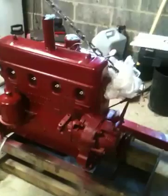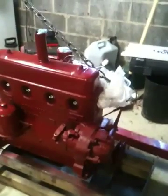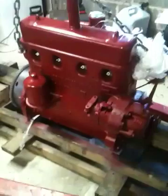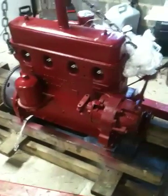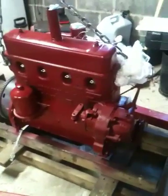I used two different kits because of the head being a Super A. I ordered a Super A valve kit and springs, and then for the 130 block — the bore is a little bit different — we used Red Power domed pistons, sleeves, and bearings, and everything worked out perfect. Then the Super A kit: three-angle valve job, new springs, valve guides, all that good stuff.